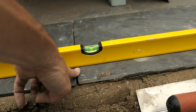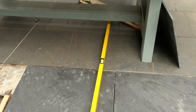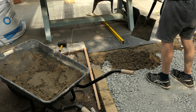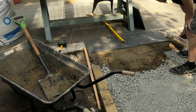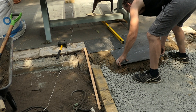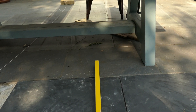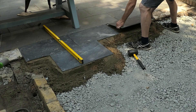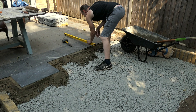There wants to be a slight slope going down the garden where the bubble is not between the lines but just touching the line. Now for the next tile — I'm going to lay one in front of the two I've already laid in a brick bond pattern. I'm checking it's all level and just building up the top left side. I've got a natural slope here again where the bubble is just on the line. The joints are all at the right gap too, and I'm carrying on in the same way, checking it's all level throughout.